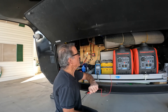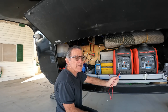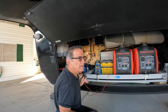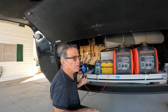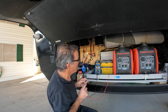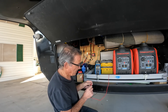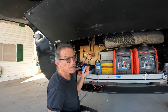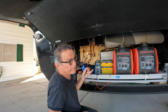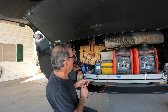I'm waiting, hoping that the charger will turn on, because one of the criteria of doing the test is that the circuit be loaded — in other words, the charger should be running and passing current through to the batteries. Right now it's not, but we can still do the test. If you're watching the meter there, you see it's jumping around. As soon as I short the terminals, it goes to zero, which is what you want. When I put it on here, what we'll be reading is the voltage drop value.